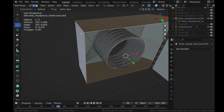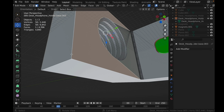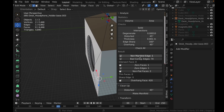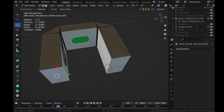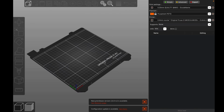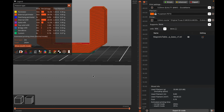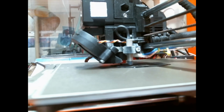I made the mistake of creating the slot to have the two magnets next to each other, which created the issue of them fighting for the superiority of the polarity they were giving out. Only one would fit in the cavity because they were pushing the other one out. So version 1 only held one magnet at a time.